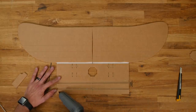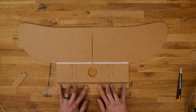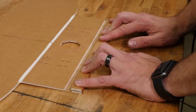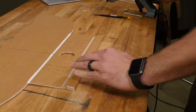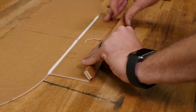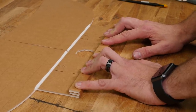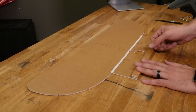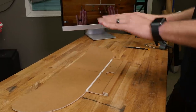Rotate this 180 degrees. Using the AdTech Pro 200 hot glue gun — you don't need one this big for smaller models — do one fold of glue, fold it over 180 degrees, and press down firmly for about 45 seconds. We're now done with the main spar of our wing, which is what gives us strength. Right in the center is where our score cut is, which gives us dihedral. Dihedral gives the plane inherent stability — when you take your hands off the stick, it will naturally try to level itself out. Our next step is to give the airfoil its shape by rolling the score cuts so they collapse on themselves. Make sure you don't open the cuts with a pen tip — we want them as tight as possible.